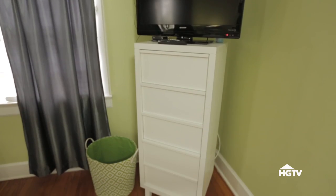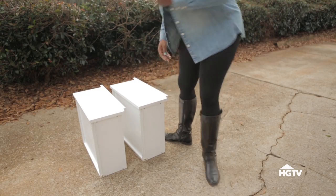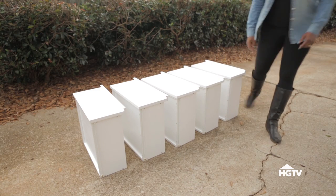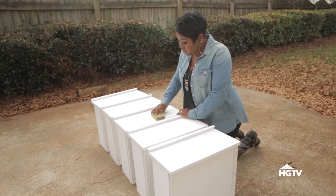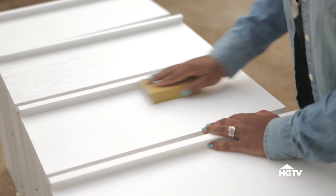I'm not talking about messing with any family heirlooms. Luckily, the dresser that was in this space was the perfect makeover candidate. Start by taking the drawers out and setting up a workspace where you can paint them and let them dry in a well-ventilated space. Lightly sand the faces of every drawer with fine-grit sandpaper — this just helps the paint take a little bit better.